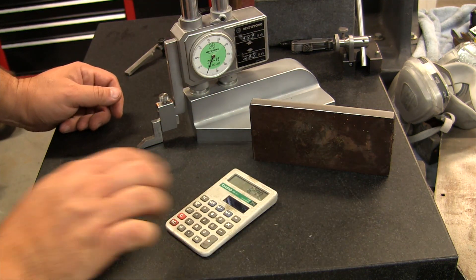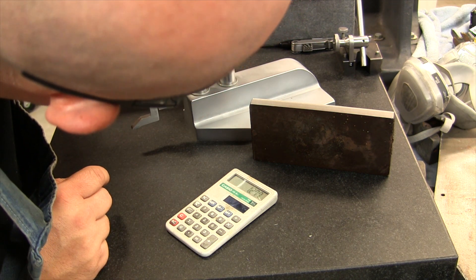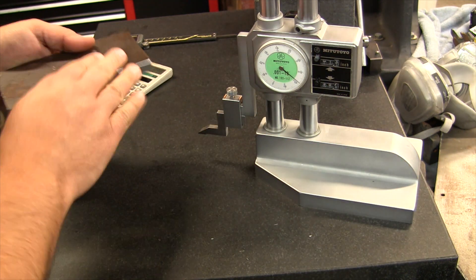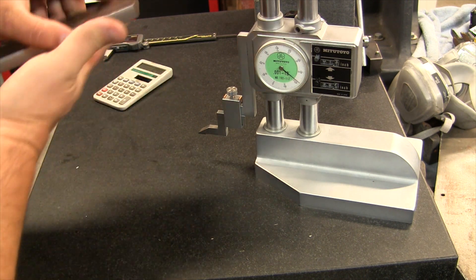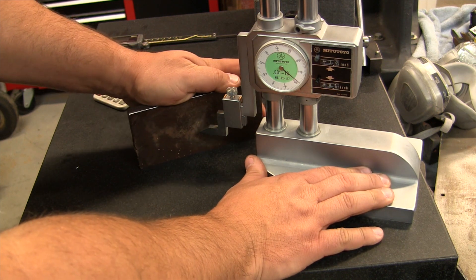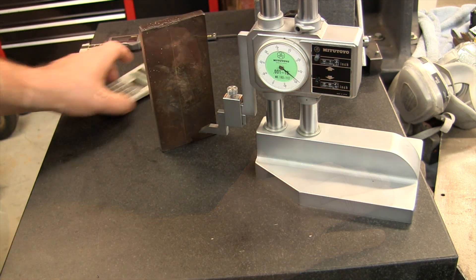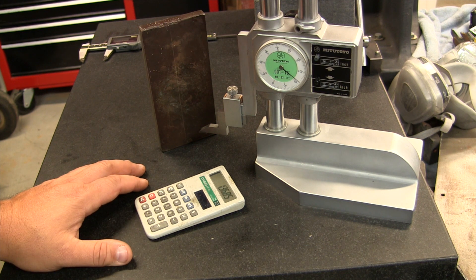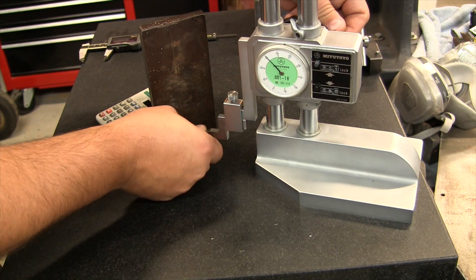We need to come up 1 inch, 277 thousandths. Let me pick a nice clean side here — actually this side's lumpy, seems like somebody was beating on it with a hammer. I want this side to sit flat on the parallels, so we'll scribe this side right here. 2 inches, 737 thousandths divided by 2 is 1 inch, 368. Let's clean off our thing here — 1 inch, 368.